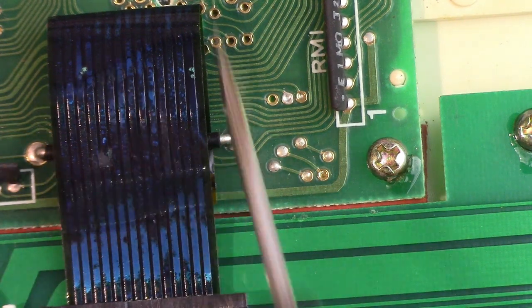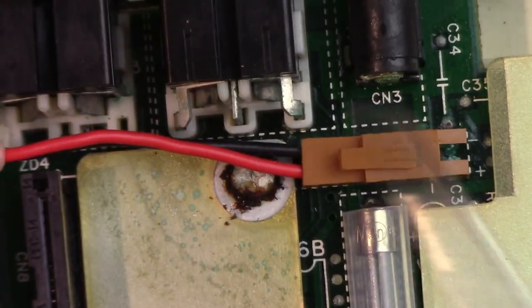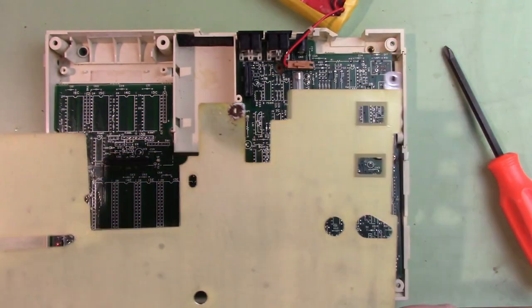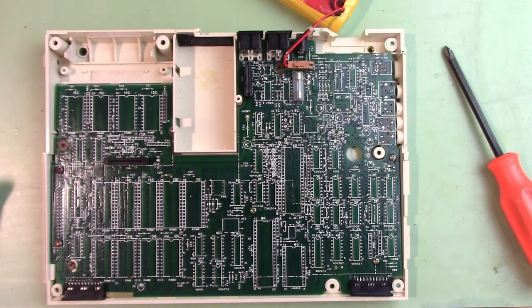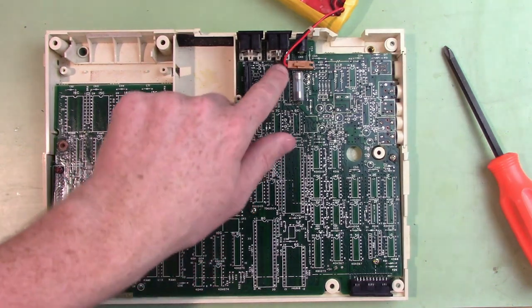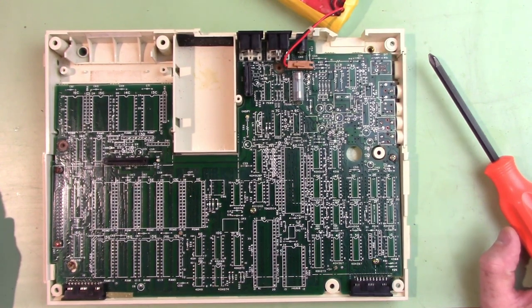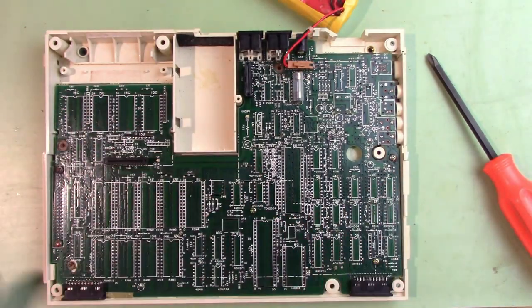So we want to clean this out anyway. I'm going to take this cover off the bottom to see if there's any more damage, because that's where the liquid would have pooled around this area. The screws are corroded — nothing looks obvious on the board other than where it's rusty. The battery terminal is not coming off easy, so it might be corroded on there. I'll take the PC board out and flip it over.